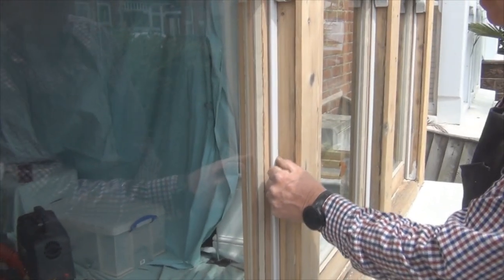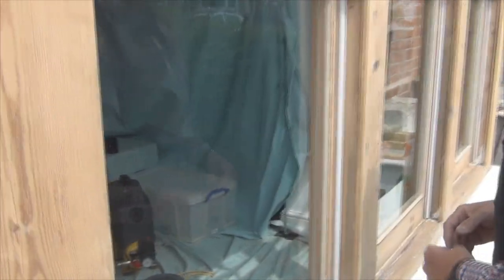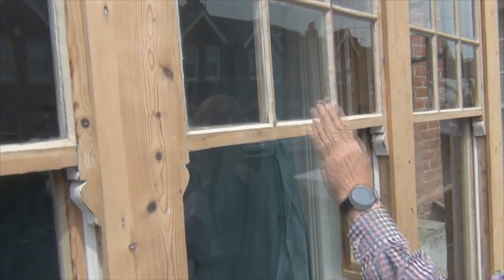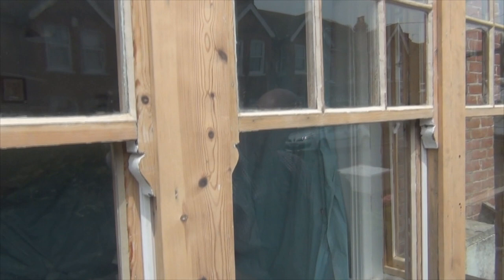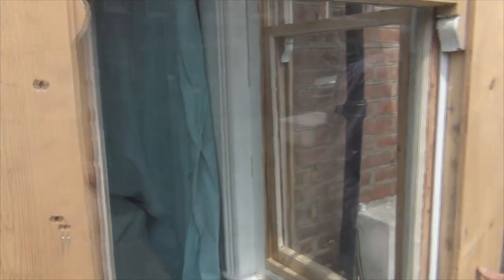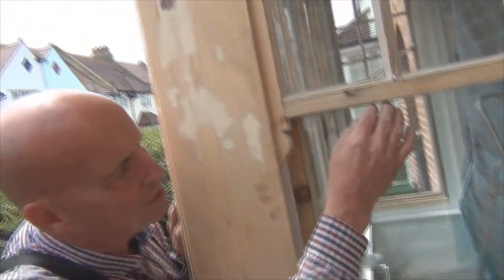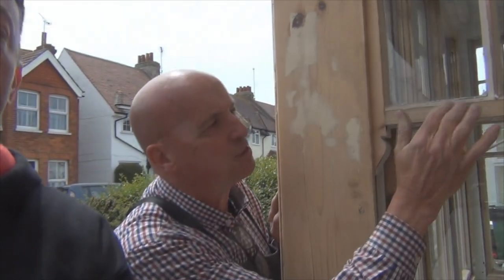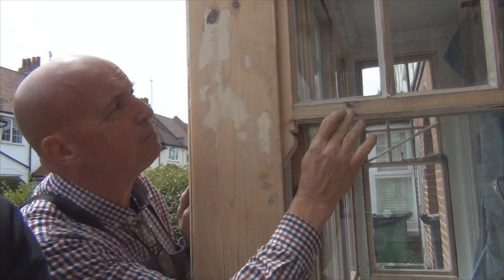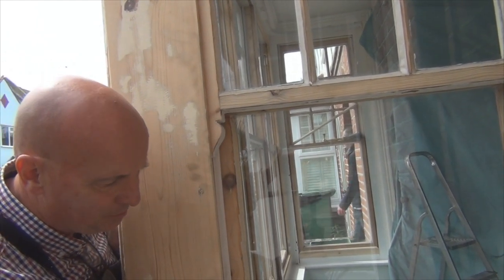As you can see, here's the parting bead again, and you can see the spring in it that allows the windows to slide up and down with ease. These ones have all been done — they've all been reputted. All the faces have been made new. We're in the process of cleaning them up at the moment and doing a final smoothing over. When we come round to this side, this is the window that we were just doing. We need a little bit more, but you can see how solid that is — that's the original wood. In fact, this is the whole top sash — it's still original. It's just needed the face made good and cleaned up.